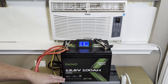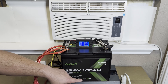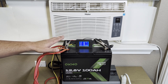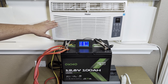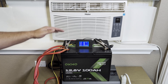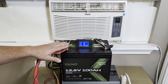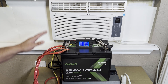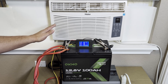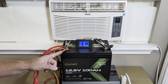The inverter is a 2,000 watt pure sine wave inverter. I have the power cord of this 5,000 BTU AC unit plugged into it — this is how I'm going to do my capacity test. The first thing being tested is whether this battery can handle the spike in power the AC unit needs when the compressor starts up. Then we'll test how long it can run this AC unit off of 100 amp hours — do we get the full watt hours expected? It's an older unit so it takes a bit more power to start, but it should still be able to run on one 12 volt 100 amp hour battery.